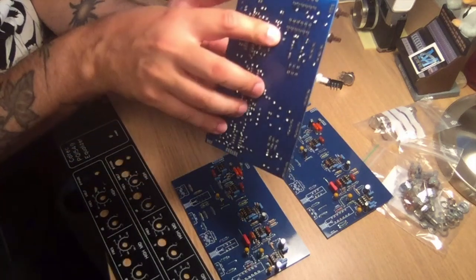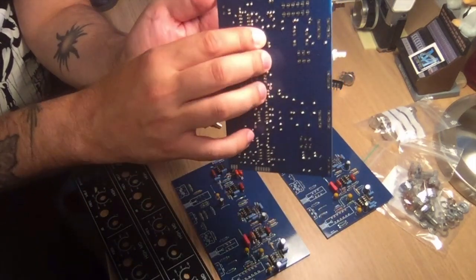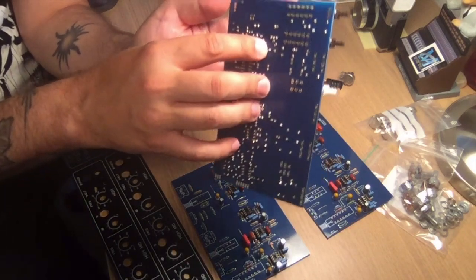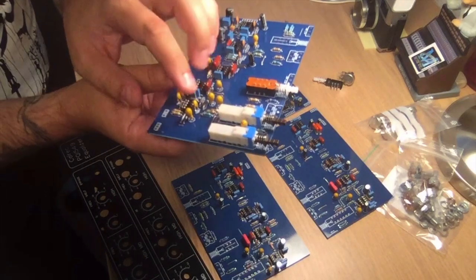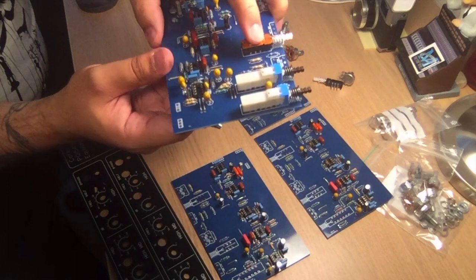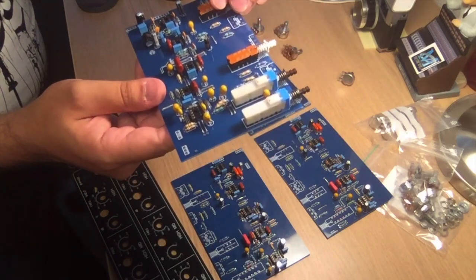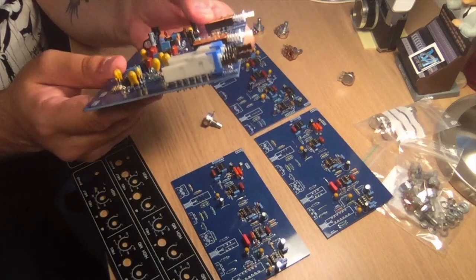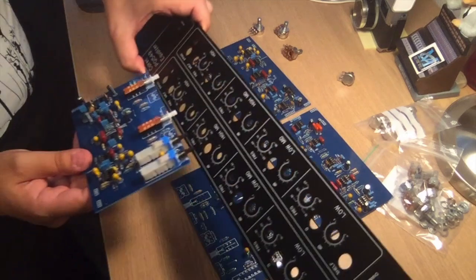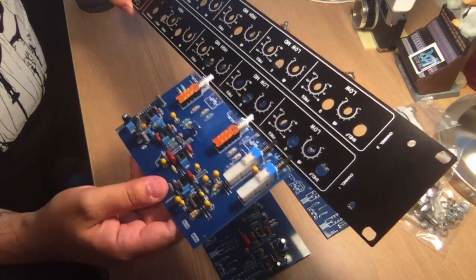I hate to have to move around all these pins here, since I have 6 on the small ones and 12 on the large ones. So I'm going to trust that these ones line up nicely, and I'm going to be very careful when soldering them. So pushing them down with a fair amount of pressure, and make sure they are in line like this. And I also have tested them on the holes like this, so everything's gonna, let's see, there we are.